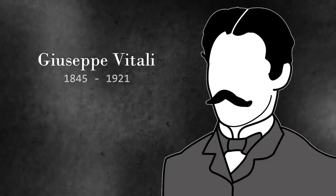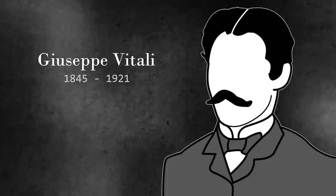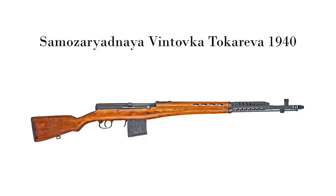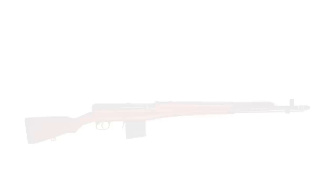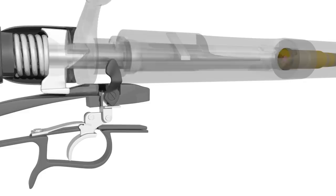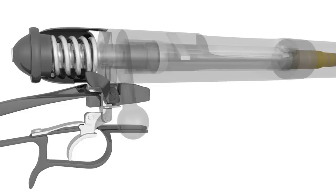It was in this role that Vitale would begin to influence the Italian Vetterli rifle. His first distinction was reforming the safety. The original Italian 1870 had no safety, but this quickly gave way to a simple trigger block — kind of like on an SVT-40. But that too did not last very long; it went almost immediately to more of a manual decocker. The Claverino safety was a thumb pad on the right side of the receiver. Pressing it forward depressed the sear; as you closed the bolt on top of the safety, it would return that decocker back to its original position while camming surfaces inside the bolt gently lowered the striker. Obviously this leaves a firing pin against a live primer and is easily subject to accidental discharge. Strike the butt on the ground too hard and you have a risk of blammo.